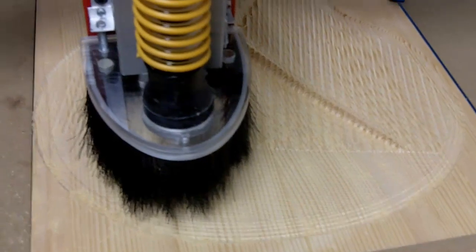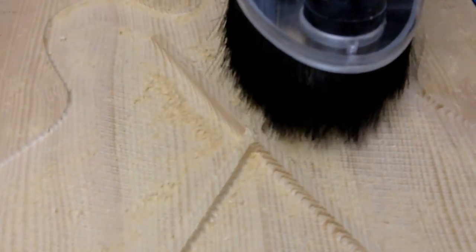I left about an eighth of an inch oversize for final tuning, and here you can see the finishing passes. I'm using a 3/8 inch ball nose bit, and as you can see it leaves a very smooth finish. I believe my step over was around 0.05 or so. A little bit of sanding after that and all those tooling marks will basically disappear.